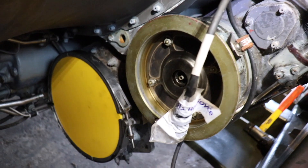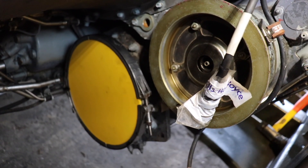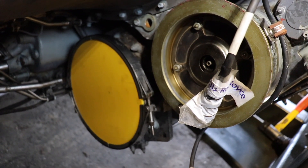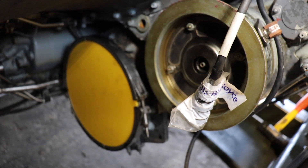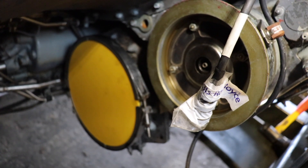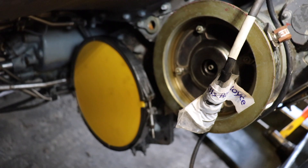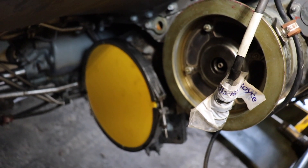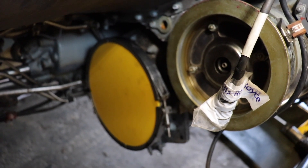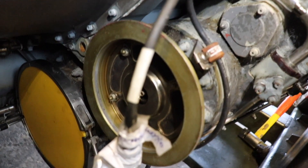Moving on — we're making reasonably good progress. On this side here is the other side of the accessory gearbox, and you can see there's another homebrew aluminium blank covering the mount for the constant speed drive. Interestingly, there's a shaft which goes right through the gearbox — the constant speed drive is driven by one shaft directly from the gearbox, and then there's another shaft which comes from the constant speed drive and connects into the generator. The whole idea of the constant speed drive is to keep the generator going at the same speed regardless of actual engine speed.